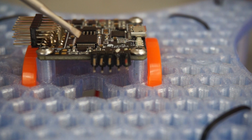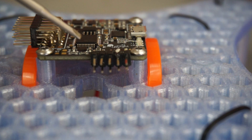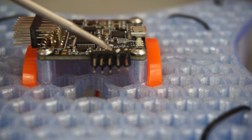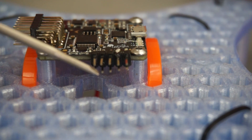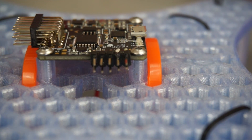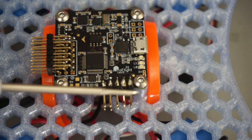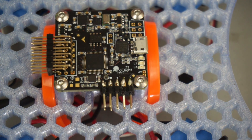These are for your receiver connections. And normally you're used to plugging one servo lead in for each connection, but in this case it's a little different. You have ground, power, aileron, elevator, throttle, and rudder starts on the second row. The other channels after that are auxiliary channels. I've seen that you can actually buy a special cable that will plug in and break out to your different connections, but in this case we're going to use standard servo leads to get our connections set up.